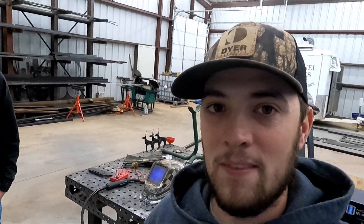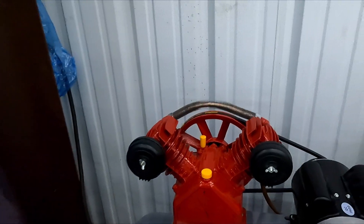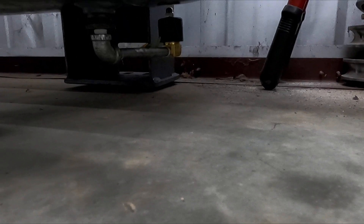All right everybody, the monkey on the table is back today. It's Saturday and I'm out here in my house shoes shooting an outro to this air compressor video. We got the air compressor all done finally. We got the pumps all nice and painted, got it all wired up, got a junction box over here. Something I don't think I touched on — there's a valve at the bottom of the tank; it's an electronic solenoid valve to help relieve water out of the tank. We had a problem with the old compressor running so much that it was building up a bunch of water. We have a small dryer system on it, but not a very big one, so anything to help. She's all done.